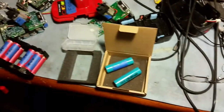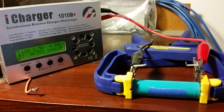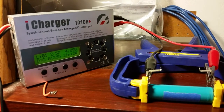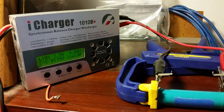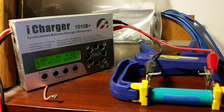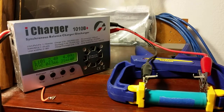We will find out what we find out. When I get them tested, I'll spot weld them back into that pack and we'll see what happens. This is the third replacement cell for the damaged pack — it's just about done. The range I tested is showing about 1600 to 1700 milliamp hours. When it's done, I'll write the capacity down on it and go spot weld that one in. That'll be three out of three.